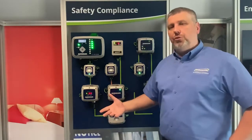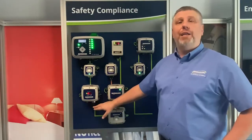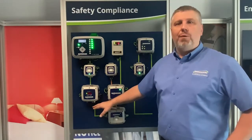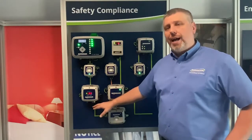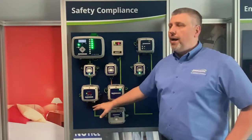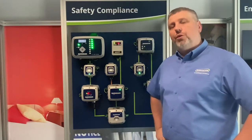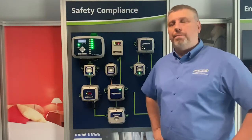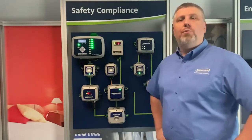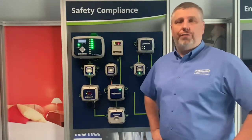The MGS 550 can accommodate either one or two sensors in the base unit, supporting different sensor technologies — for example, an infrared sensor for measuring CO2 and an O2 sensor for measuring oxygen in the air. In addition, the unit has three fully programmable relays which can be used to switch on and off additional devices.